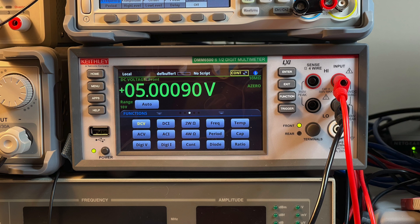First, we'll start with a written review — the link is in the description with lots of detail. The way I determine accuracy is I have a Keithley DMM6500 calibrated within the last 12 months. I use that to parallel the measurements — voltage, currents, capacitance, resistance — and use it as the judge of accuracy. Basically, all accuracy is measured compared to the Keithley, which is a 6.5-digit bench meter.